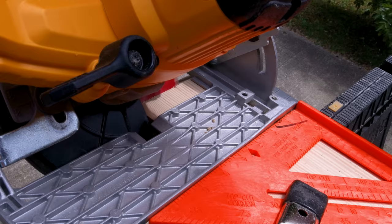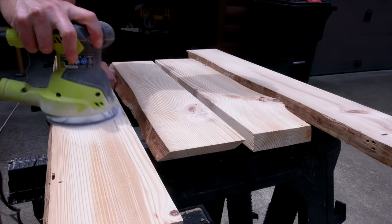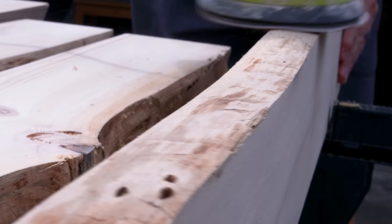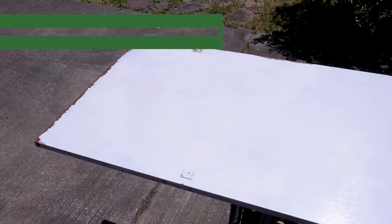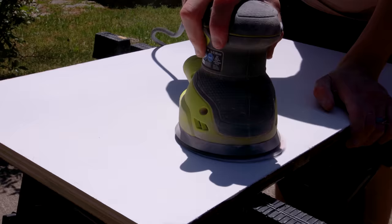These two flat surfaces allowed me to square off the ends of each board. At this point in the process, I could finally account for the 45-degree angle that's necessary for the waterfall edge. Starting at 60 grit and working all the way up to 220, I gave all the boards a proper sanding. I'll construct the remainder of the table with reclaimed three-quarter-inch thick plywood — I cut it into various sizes and sanded them to remove the paint.